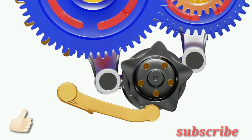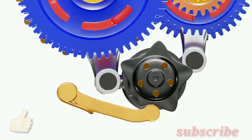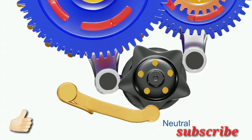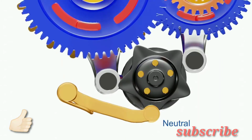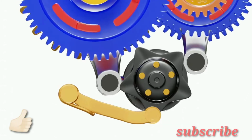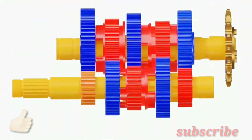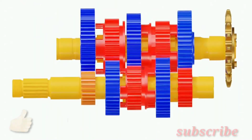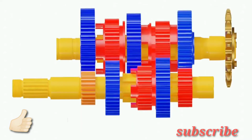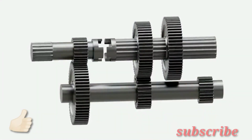But one of the ridges of this plate is ground off, as we can see here. This is done in between first and second gears so that the roller can briefly rest on this ground-off surface, thus enabling the shifter drum to stop at neutral position instead of shifting directly to second gear. The transmission system we showed here is known as constant mesh transmission system because all gears remain engaged with their corresponding gear mates at all times.